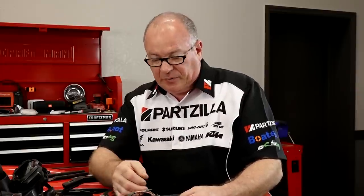Evidently the owner went in there, stripped it back, made some type of connection for who knows what — a stereo system, a set of lights, I don't know. But that was a big mistake. He pulled the cabling out because it was not present on the machine, and just wrapped the wires back together. Well, that left them exposed. Eventually they were rubbing together, they started to burn, and when I actually pressure washed it, sent some water down that wire, started making the connection, turning our display or our machine on and off.